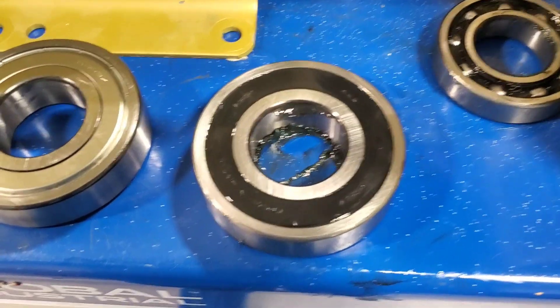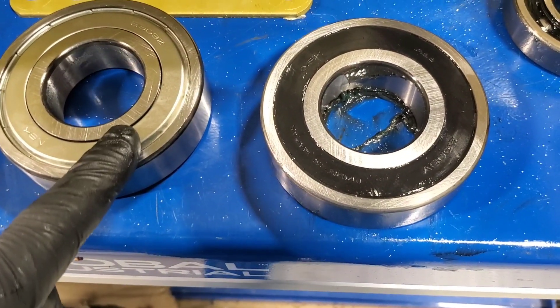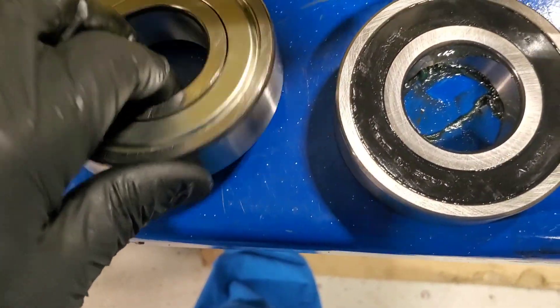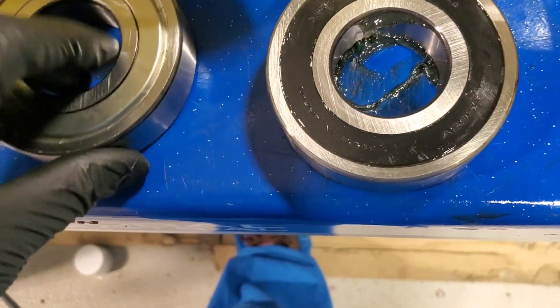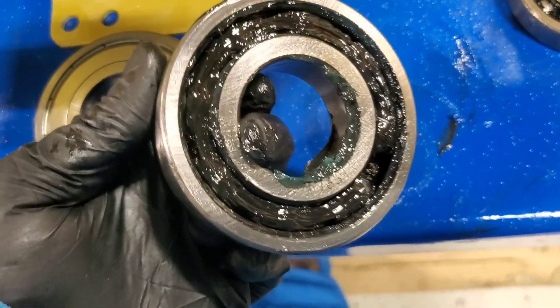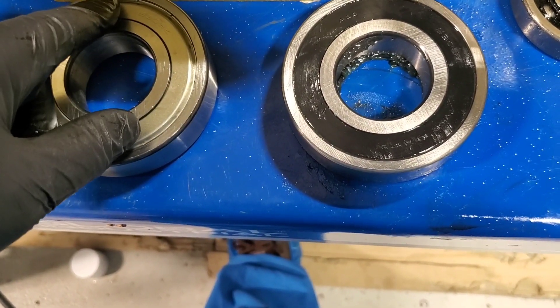For comparison, here's your shielded bearing and here's your sealed bearing. The shield is only a dirt shield — it protects the bearing but is non-contact, meaning it does not touch the inner race. The sealed bearing is contact — this one doesn't spin freely. So I'm going to pick one shield out. The shield side will go to the grease side.